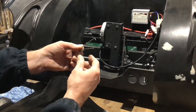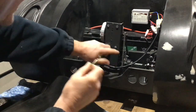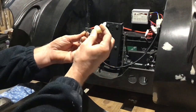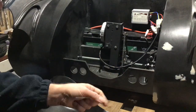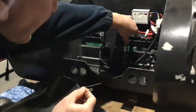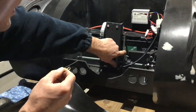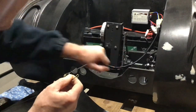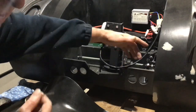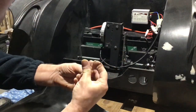Today I'm going to make a chain tensioner. I've found this spring clip and I'm going to fit it on the inside of the motor support bracket. I've got a nylon bush — I'm going to fit that onto this clip with a bolt and this small bearing. When I fit it onto the motor support bracket, it'll take up the slack on the chain, stop it vibrating, and stop it jumping off. I don't want to pull the motor too high because that'll have the chain too tight and it'll wear the chain very quickly. It's better to have a chain tensioner fitted.